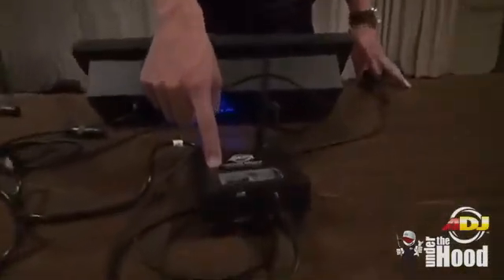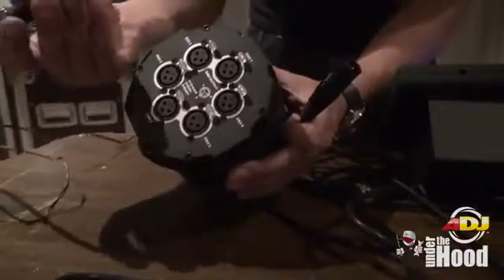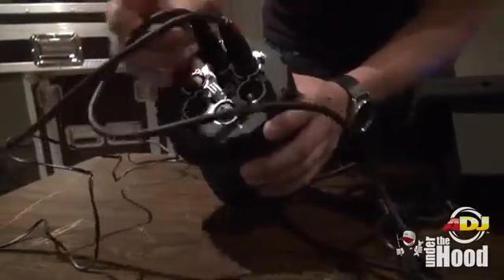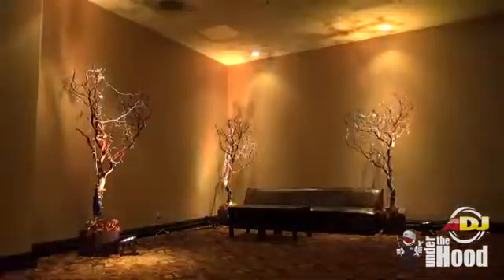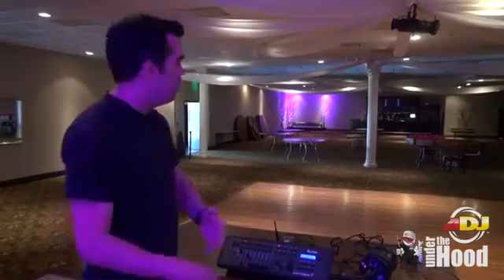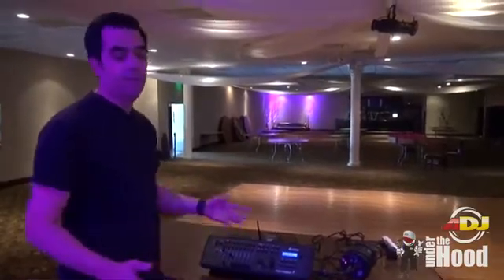I've got my wireless DMX transmitter here. I have uplights back here, but I'm not going to run those wirelessly — that's where the D6 branch comes in. I'm going to come out of my DMX controller to the DMX in on the branch. I've only got two outputs I need to use, so I'll put the first one here and plug my wireless transmitter into the second one. You can see there's a total of six, so you can have it going six different directions. Now we're going to test the lights on the trees way over there — about 30 yards away. There we go. Now I have control of the trees on the other side of the room without having to run DMX cable all the way around, over the doorway, into the back. It makes things a lot cleaner and you have happier customers because they're not tripping over DMX cables.